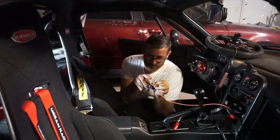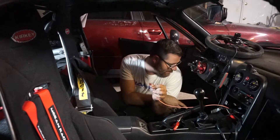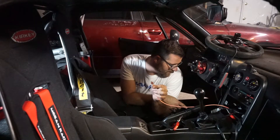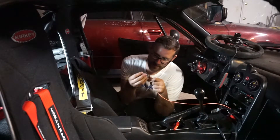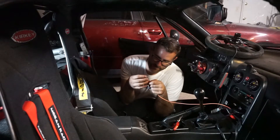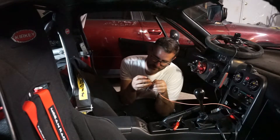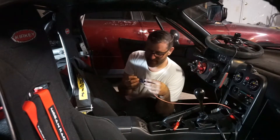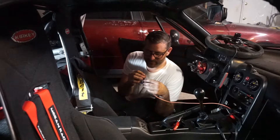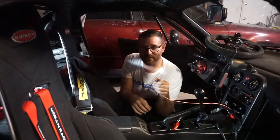I have black, red, white, and green. Looking at the pinout reference: pin 1 is white, pin 2 is green, pin 3 is red, pin 4 is black. That is correct — everything is A-OK. Now we're going to slide this into the connector and you'll hear all four of them snap, which is a good thing. We put that in there and shove this little locking piece in, which locks it all into place.